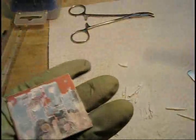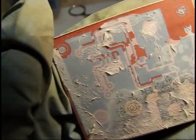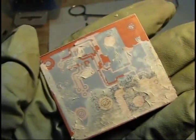I've seen people rip traces right off like this, and you can still do it, but if you go carefully and design your board correctly it goes pretty quickly and easily. A good tip is that in areas like here and here, those aren't right angles — those are actually 45 degrees. Those 45-degree angles help ease the strain on the trace, or rather the toner, and prevent them from being ripped off during this process.